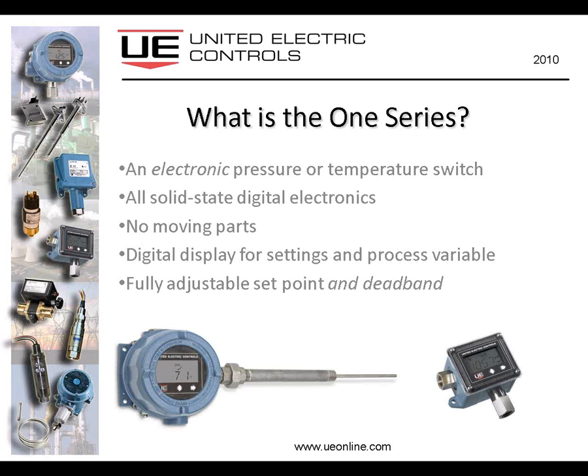The 1 series is all solid state. Therefore, it has no moving parts, and that provides a unique advantage, particularly when you compare it with a mechanical switch. Consider, for example, an application where you might have a high cycle rate. On a mechanical switch product, that high cycle rate would cause the switch to have a shorter lifespan, whereas with the electronic switch, it really doesn't matter how often it switches. Also, consider shock and vibration, how that can affect a mechanical product versus the 1 series, again, with no moving parts. It really has little or no effect whatsoever. There's a digital display included, so you could say that the 1 series is not only a switch, but it's a gauge as well. And, of course, if you consider potential leak paths for whatever the media is that you're measuring, this could be an advantage.